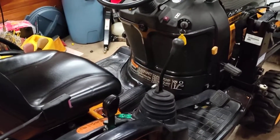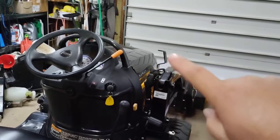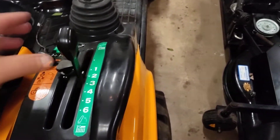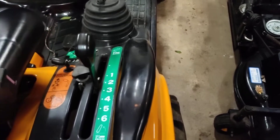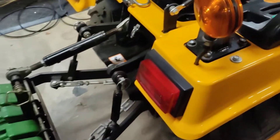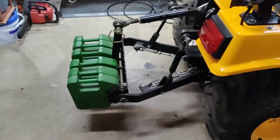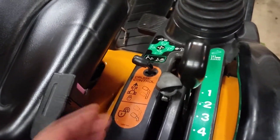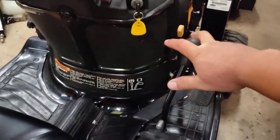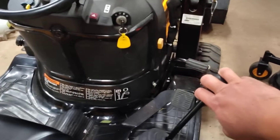There's a lockout switch there. Compared to BX2360s where the loader handle is more of a reach, this is a really good place to have it. Also on this side, you've got full position control, which is nice as opposed to the quarter-inching valves that the Kubotas have. This little lockout knob lets you lock the implement to whatever the ideal height is — in this case the rear weight rack is sticking straight out for best leverage, but you can move that lockout anywhere. There's cruise control that locks the treadle pedal in place, and a nice float mode when you push it all the way up. When you're dumping the bucket, you can do it slowly or quickly.